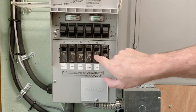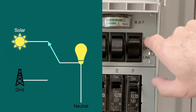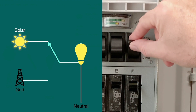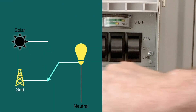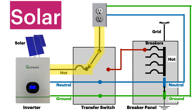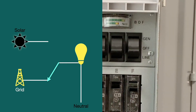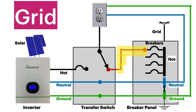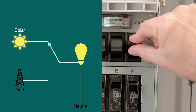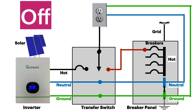When you're finished wiring up all of the circuits you want to use, here's how it works. Each rocker switch controls the source of power for the load. When it's up on generator, it's getting power from solar. When you flip it down, it's getting power from the grid. In solar mode, the electricity comes out of the hot of the inverter, powers the circuit, and returns by passing through the neutral of the breaker panel back to the inverter. When you flip it down to grid, the electrons take a slight detour through the transfer switch, but otherwise the circuit works the same way as before. There's also a center off position on the transfer switch where the circuit gets no power from either solar or the grid.